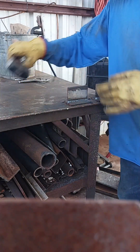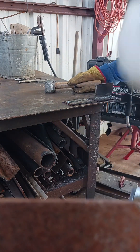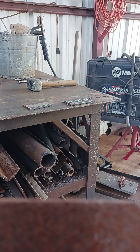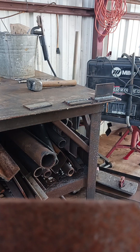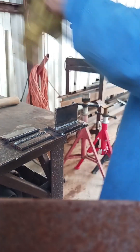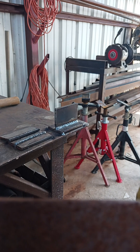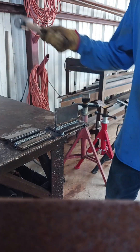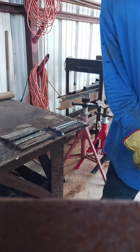I'm hoping they both break so we can see where they broke. The tack broke - let me help my welder back up and tack that better. You've got to know you have the setting right when you tack it. Back again. Let's see how many whacks it takes to break it - this one was one or two. Big difference.